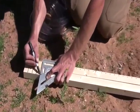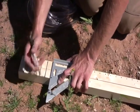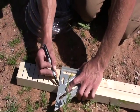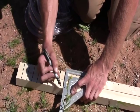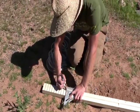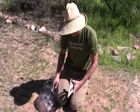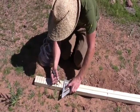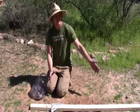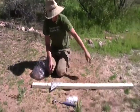Since we want them to have the same markings, we want to mark them at the same time rather than take the measuring tape and then go do marks on the other one separately. Since we're really only measuring relative elevation changes, it doesn't matter if they're inches or some arbitrary number — you could go down the first one, mark however many increments you felt like, and then just relate that to the other side. You don't have to go all the way to the bottom or top; really the middle section is where the water is going to be most of the time.